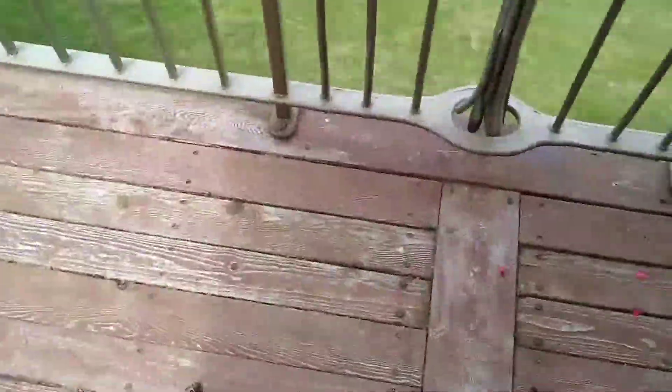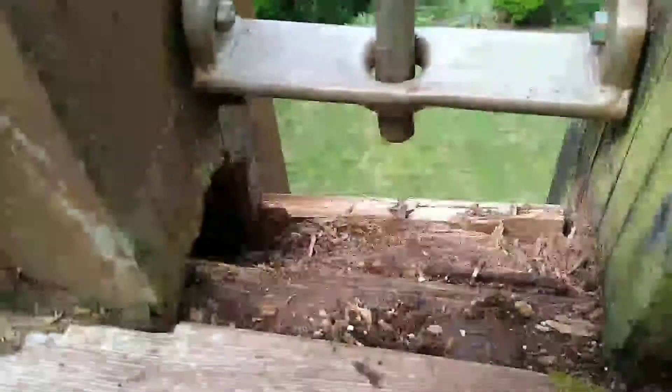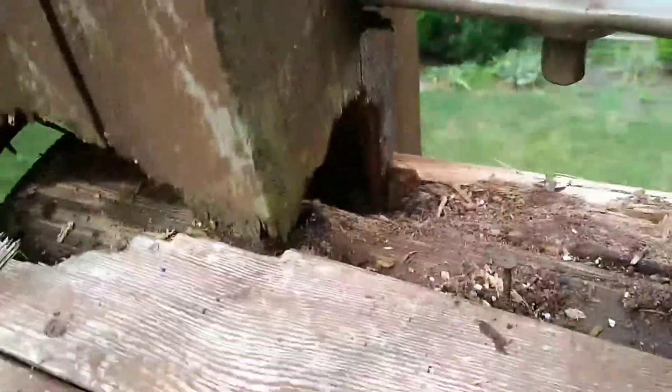I think you should remove these handrails — the front one — and pull up the first two deck boards. One's a breadboard and the second one is just covering up the first beam. Expose that beam right there, which has an inch and a half or two inches of the front. It's a decorative stair-stepping thing going down to the surface, but why they notched it was just stupid — they took most of the pole away when they notched it. It didn't have to be that way. There's like nothing holding this; it's all just mush.